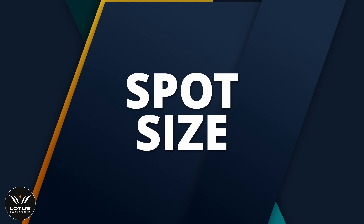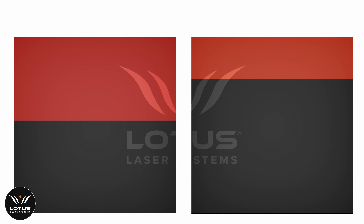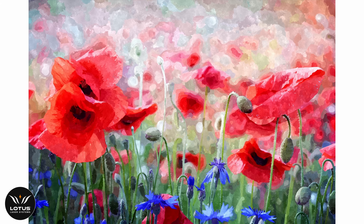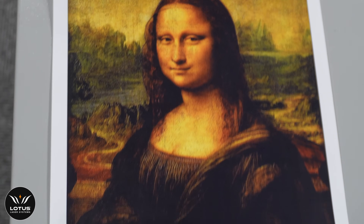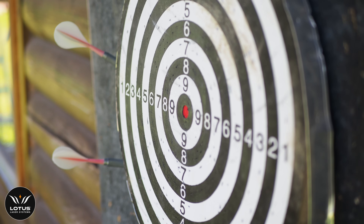The first thing is spot size, and this is the easiest to grasp. A bigger spot size covers a larger surface area and is good for quicker work — if the spot is twice the size it can cover the area in half the time. But if you think that automatically makes it better, imagine trying to use a paint roller to do a watercolour painting, and you see why it's important to have a smaller spot size if accuracy matters. But even for a laser with a small spot size, that accuracy goes out the window if the laser isn't focused.